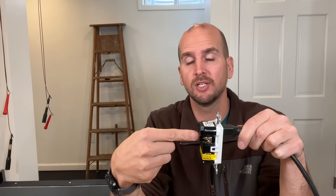In the case where there's an alternate path — say there was a short and you touched the piece of metal, making yourself an alternate path — some current can flow through you to ground. That will be detected because that current is not going back through the neutral. That difference, or delta, is detected by the GFCI, and in as little as five milliamps, for a fraction of a second, it will shut down the circuit, cut off the appliance, and save you from electrocution. That is why the ground has nothing to do with the GFCI tripping — it's the monitoring of hot and neutral, and it operates independent of the ground wire.